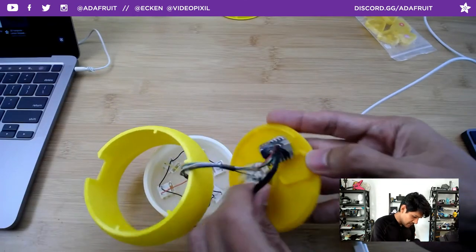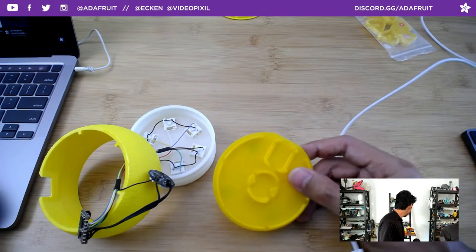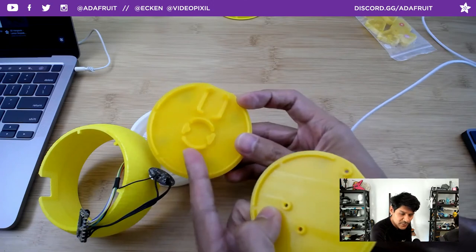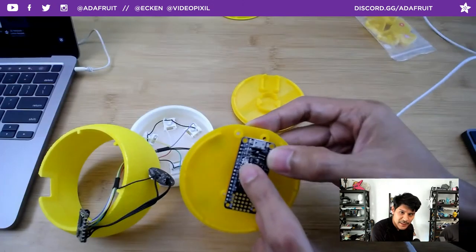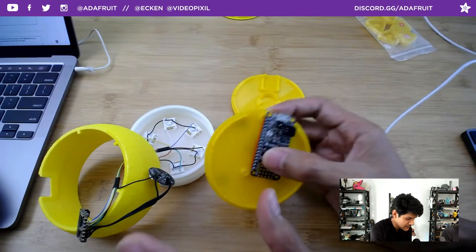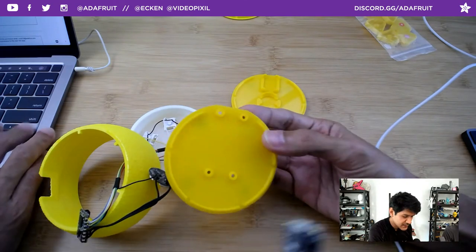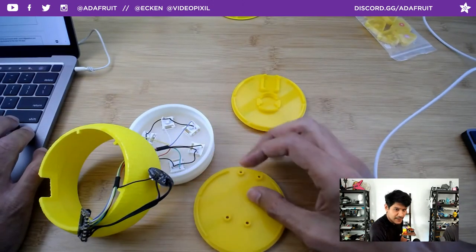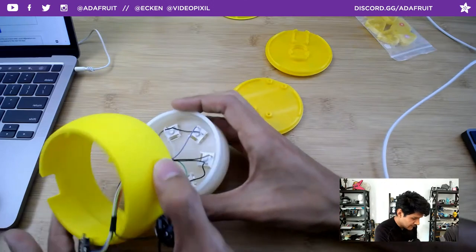It's a snap-fit enclosure with no custom PCB — just free wiring. All the ground connections are wired and run directly into the pins. There are six keys and about eight GPIO pins on the QT Py. This is a great little board — it has the new RP2040 chip from the Raspberry Pi Foundation.